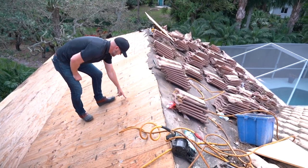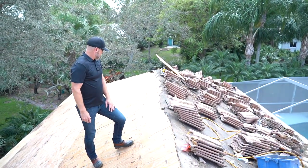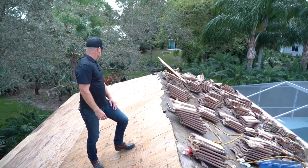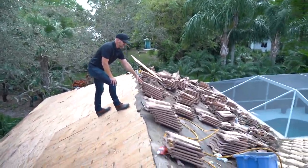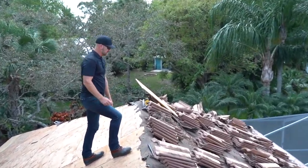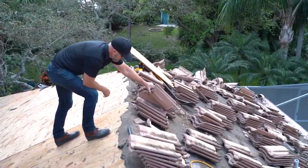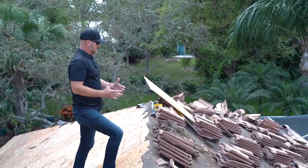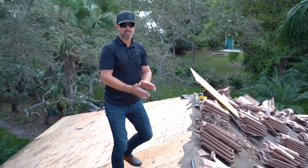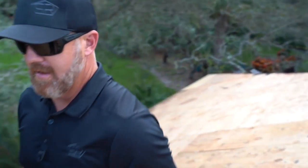What we're looking for right now is the nailing pattern. The nails are spaced properly. I'm going to look for a box of nails to determine the actual length — you can't always tell by the heads of the nails. I've already taken a couple of pictures while I'm up here. The existing roof type is a tile that simulates a Spanish S look as far as appearance, and this tile is all nailed down. So you have thousands of nails in this roof because it's a nail-down system. The new roof will be a foam adhesive that secures the underside of the tile, so you won't have all these nails going through the roof. Let's go grab a box of nails and see what these things look like.